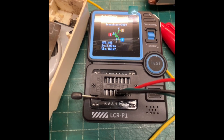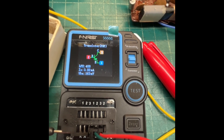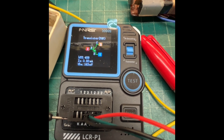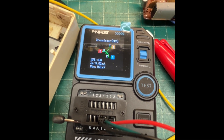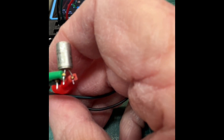You can see my IF amplifier transistor that I had in there when I was substituting transistors — HFE of 408, a lot of gain. I think that's what's causing my oscillation. I've got a different germanium transistor I'm going to throw in there. Here's what I've got: HFE-42, a 2SA-52. Let me try that and see what happens.